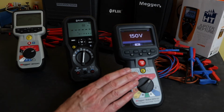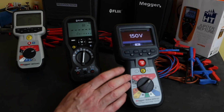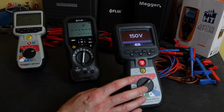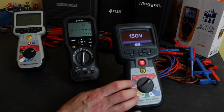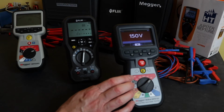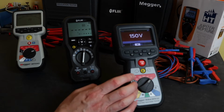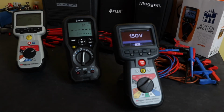and obviously with this you can pick this up at 100 volts if you use that test voltage. A variable function is quite useful for me in my work. I have DC systems at 120 volts and generator rotors that can have all kinds of weird ceiling voltages or max excitation voltages that I can set the instrument to and test at that voltage level and get a better test than just using one of the standard test functions there.